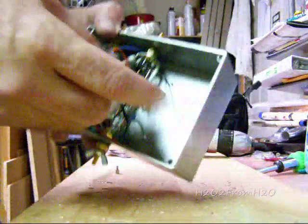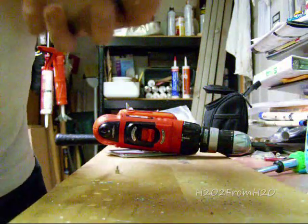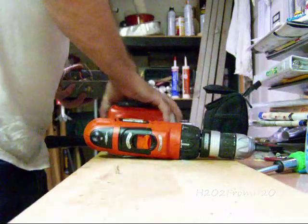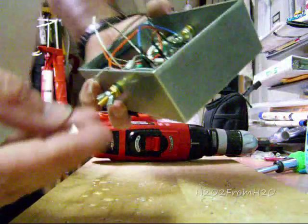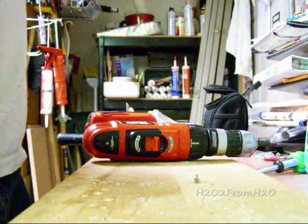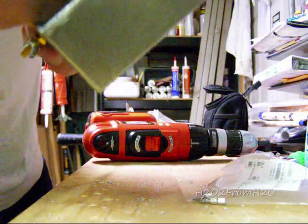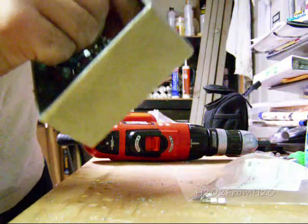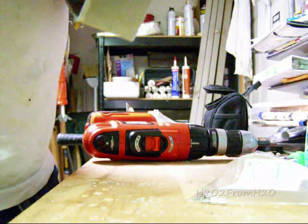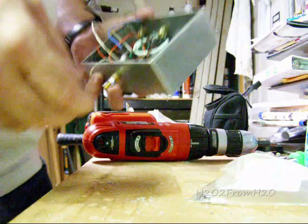and then we have two protruding screws, two more there, and what we'll do is we'll slip a lock washer on that, and then we slip on a hex, I call it a hex screw, I call it a jack screw, and that'll slip on there. The jack screw or the hex screw, jack nut, they're those little threaded nut combo screws that go on the end of RS-232 cables. That's one use for them.